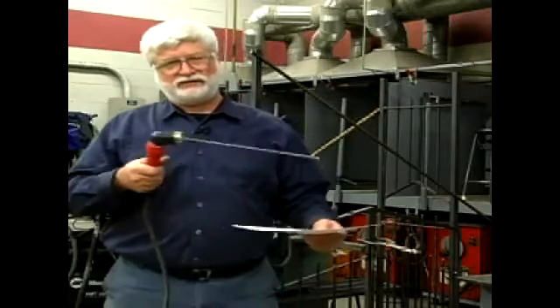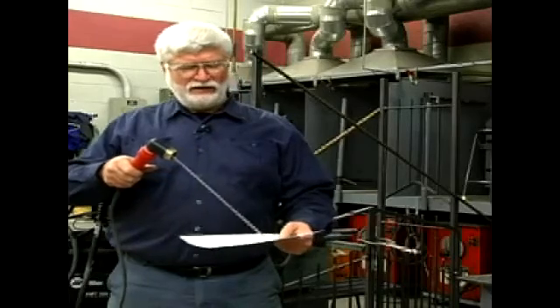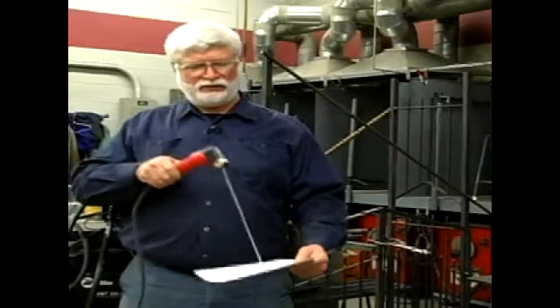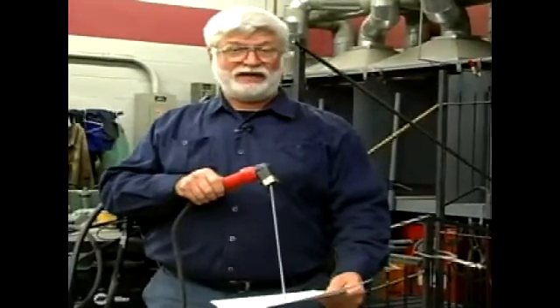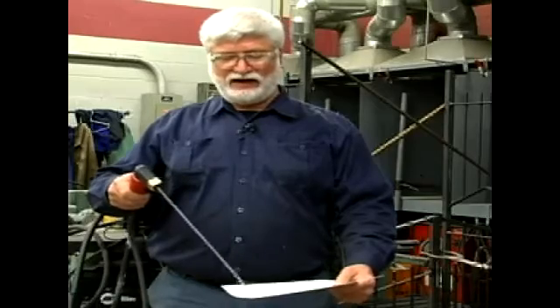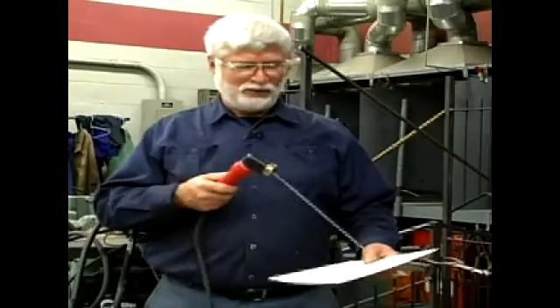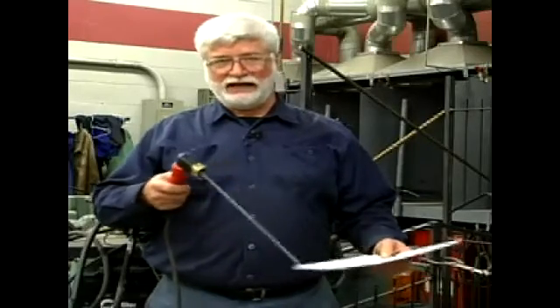The reason why we do this for students is they need to be able to see the puddle at all times. We don't want them to get it in behind the electrode holder where they can't see it. So hold the electrode like that and proceed at an angle like that. A nice, even, smooth speed of travel, the appropriate angle on the electrode, and we will proceed to make multiple passes on the plate, fill it, and make nice, cosmetically good-looking welds. It's very important.